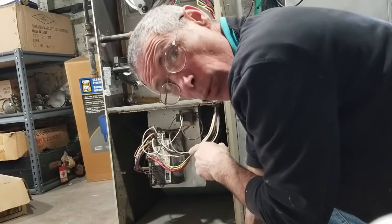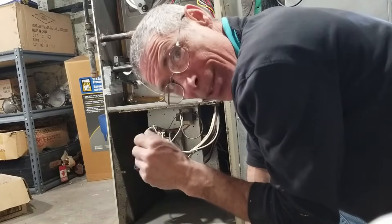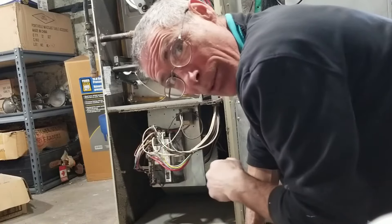I'm gonna go shut off the power both at the switch and at the breaker. These things run on 220 volts, single phase. So you don't know where the power is coming from — make sure both are off.